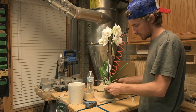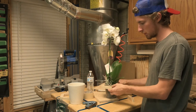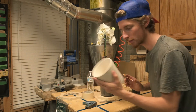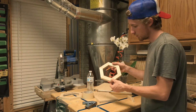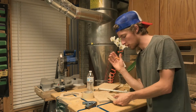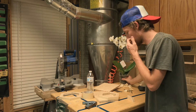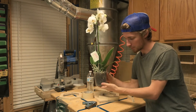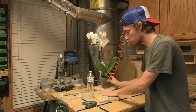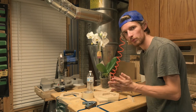Here's the plan: I'm going to use this little lip as the holding piece, sitting right there. I'm going to shrink these pieces down to about a half inch. There's going to be a top rim and a bottom rim that the pot will sit on, then we'll connect those with some slats. I'm thinking white oak for the rims and ash for the slats. Let's start ripping down some white oak.